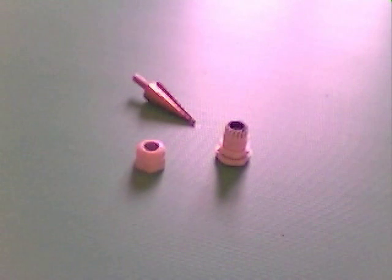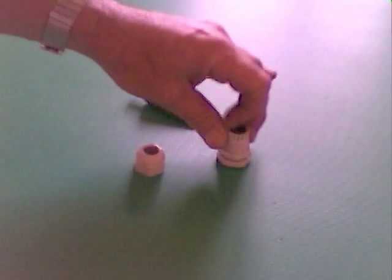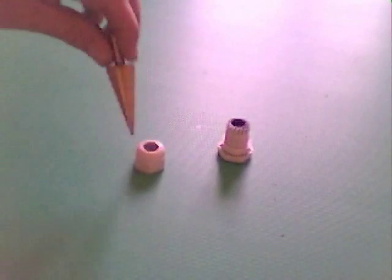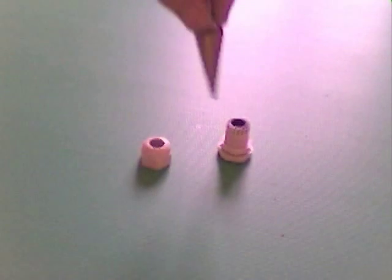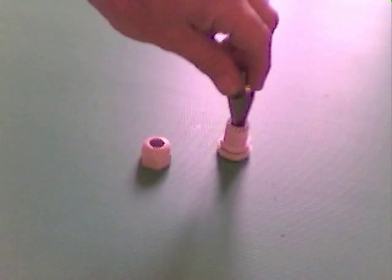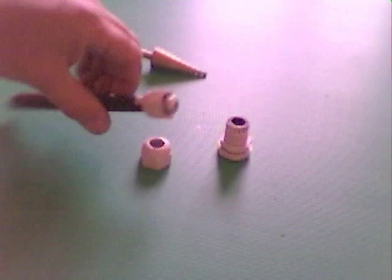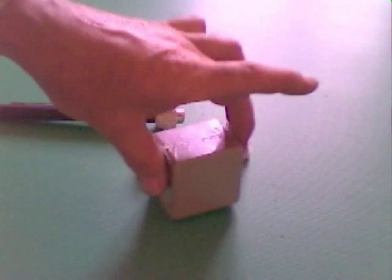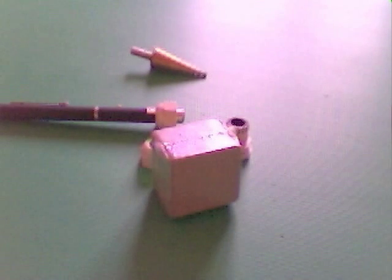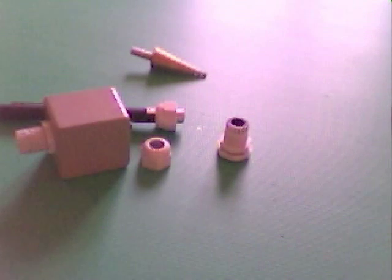Modifying the cable gland. First thing you need to do is to get rid of the bit of rubber inside here because that makes it too small to use. We'll then use a step drill to drill the outer part to accept the laser pointer, and once the rubber is out you can use it again to drill the other part out, which allows you to just push it onto the end of the laser pointer — and as you can see it sits there pretty easily. The next thing you'll need to do is, again using the step drill, drill out your box so that you end up with the cable gland in the end like that.